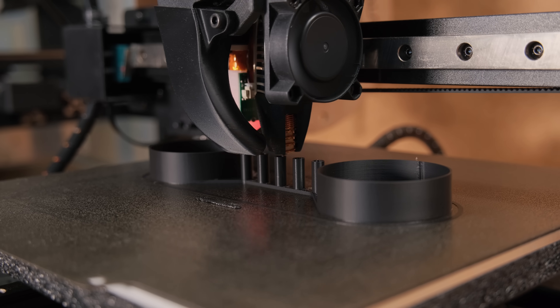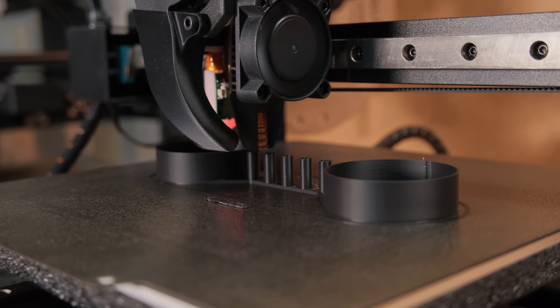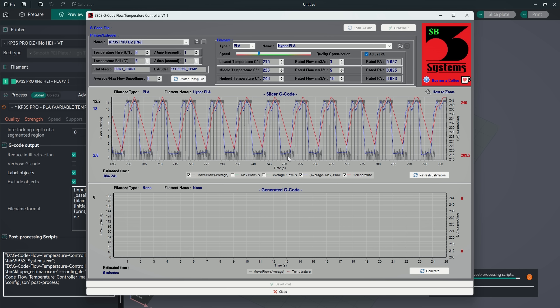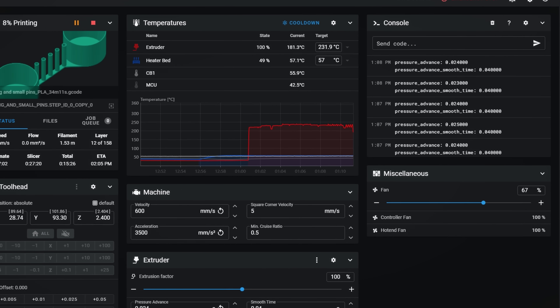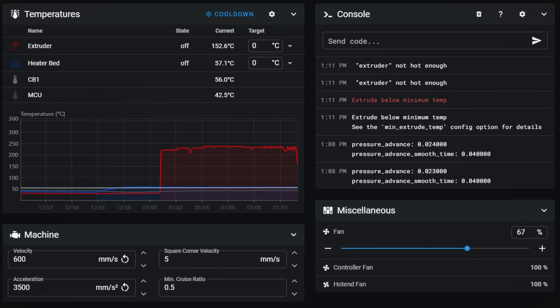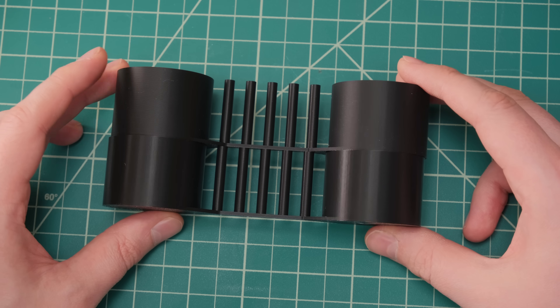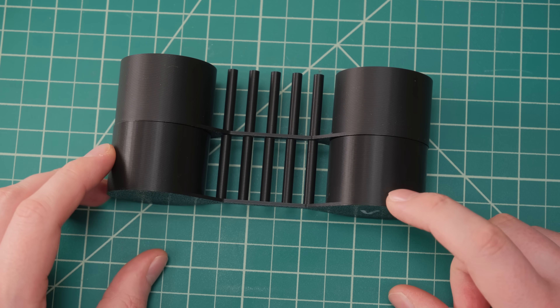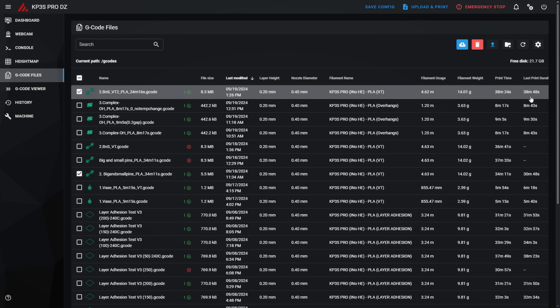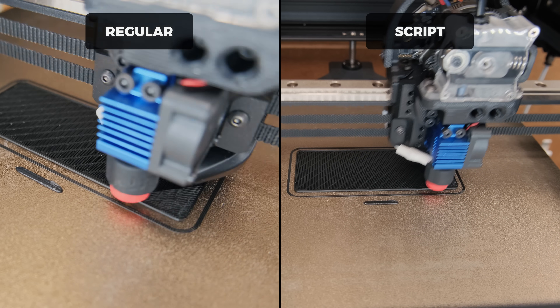The torture test had quite a few slow sections that quickly transitioned to fast ones. Unfortunately, due to low smoothing levels used in the script, the rapid temperature changes caused the inductive hotend's control board to constantly error out. I tried less aggressive smoothing values and while it worked and produced a better-looking print, the increased smoothing also increased print times, because the script adjusts printing speed to allow more gradual transitions between temperature changes.